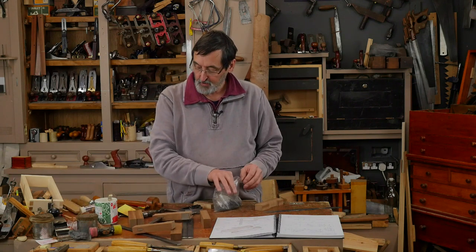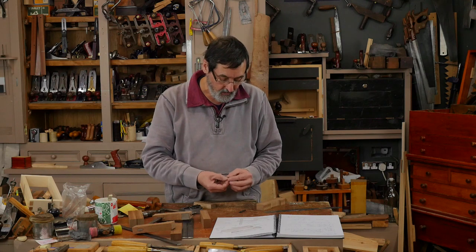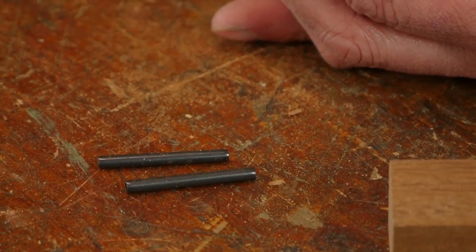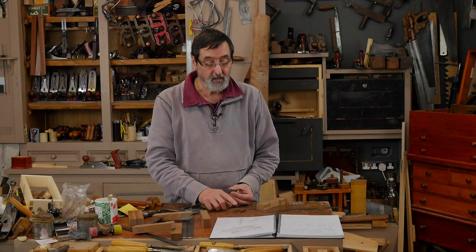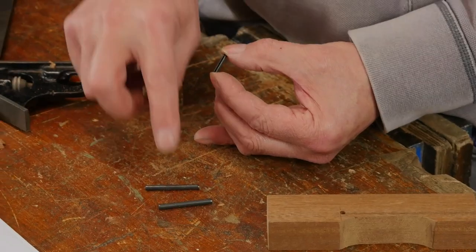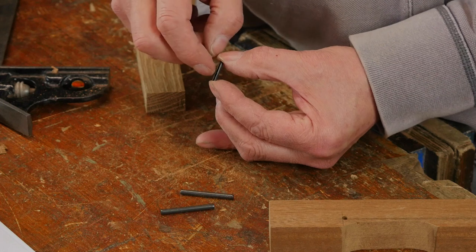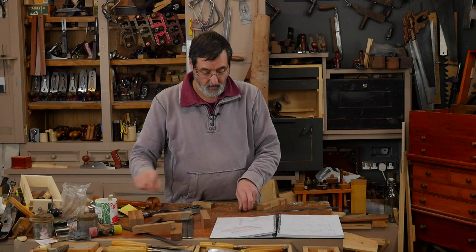To get these two pieces, we're going to use what we call a roll pin. I just bought a bag of roll pins on eBay. Roll pins could actually be split as well — here's one that has a split all the way down the length of it. This one is different: it rolls into itself. So when you drive this through the hole, regardless of the size, this one is made for a four millimeter hole. When you drive it in, the roll rolls into itself and gives a continuous bar. This one is slightly oversized on four mil — when you drive it into the hole, it closes up.